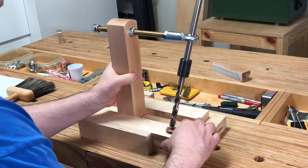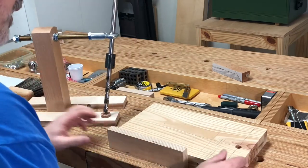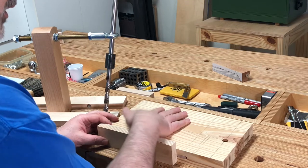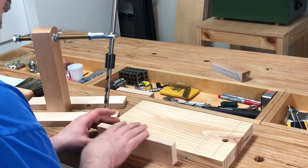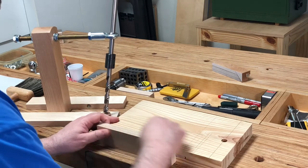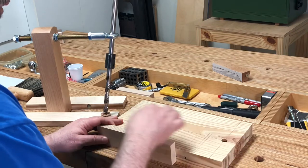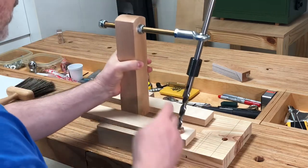What I've come up with is this simple fixture that I use when I'm building the jigs to calibrate them. It's just a piece of 2x8 construction lumber that's been jointed and squared — it's four-squared. I've added a fence here, though you don't even need it. I've struck a line that's 3 inches from the end of this, which represents the center line of the jig. That corresponds to the center line here on the jig.